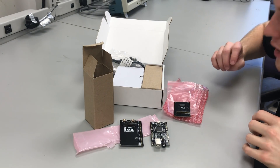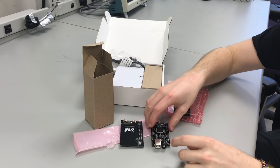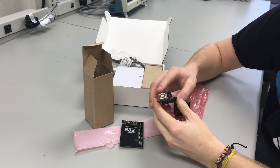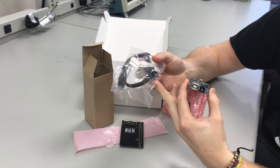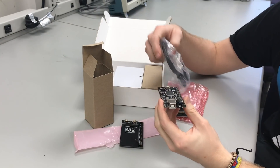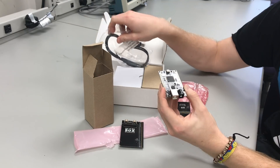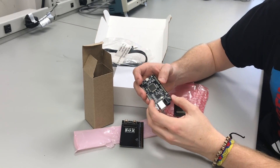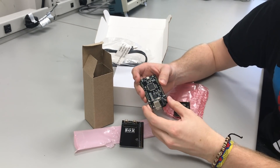Before we go to the actual accessory boards, I want to mention the cables that connect to the Mupad. The Mupad has access to a USB-B connector, which connects to your computer with a USB-A cable. This USB-A to B cable plugs from your computer to the Mupad, used to power the board most of the time as well as program the board, because there's an onboard programmer — so we don't need an external ICE component like other Atmel processor setups.